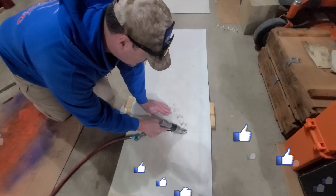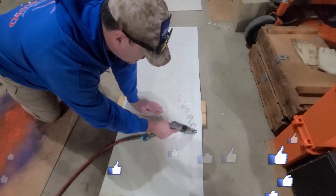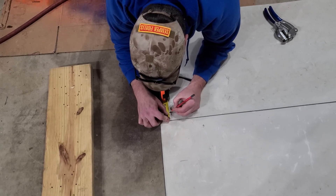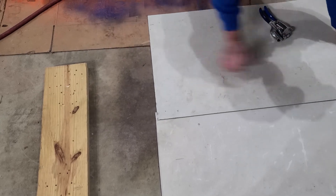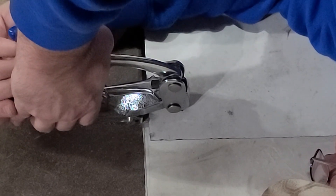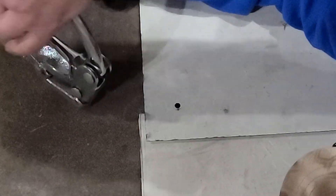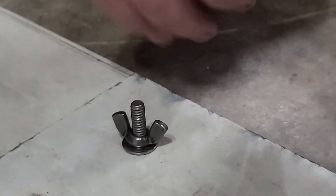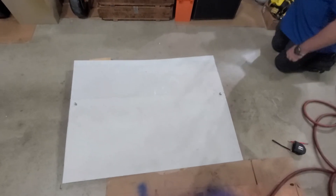We're cutting two sheets down to four feet long, then combining two sheets to get a three-by-four foot piece. Now we're marking where we need to place holes so we can put the two sheets together — measuring carefully before creating holes for bolts, butterfly nuts, and washers. We used one panel over another to line up where the holes needed to be, then added stainless hardware bolts with washers and butterfly nuts. This gives us our three-by-four sheet to use as a ground plane counterpoise capacitive coupling piece of metal.